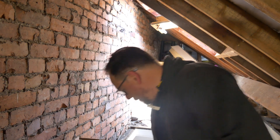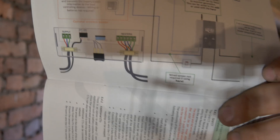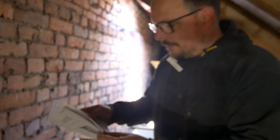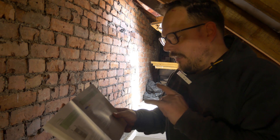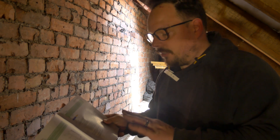There's a detailed manufacturer's instruction book that comes with this — you get the user manual for the customer and the installer instructions as a separate document. Looking at the wiring diagram, you've got your supply in — you can take these from a 13 amp fuse connection unit, though we know what can happen with heating elements. You've got two heating element outputs. One or two purely resistive loads may be connected, such as water storage heating elements or storage heaters, but only one output is active at any time. The maximum rating of each load is 3.68 kilowatts and the minimum heater rating is 150 watts.